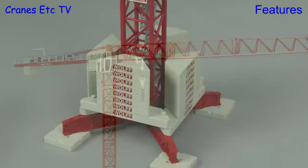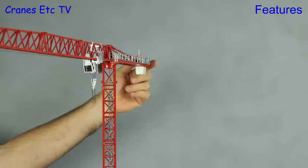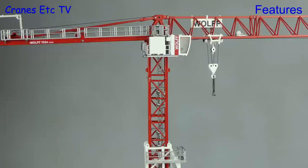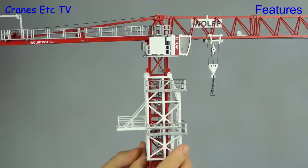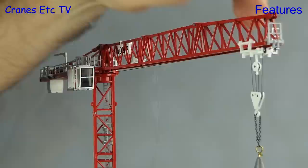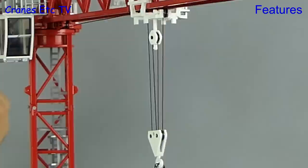Moving on to functionality — the crane rotates really nicely, very smooth without any juddering or jerkiness. Here it is with the 30 metre jib; you'd need a lot of space if you rig it with the 75 metre jib. The climbing cage can be offered up and bolted into position, but it's normal practice to have it lowered when the crane is working. The trolley can be moved along smoothly by hand, and here we've got a small weight on the hook to help the hoist rope run smoothly. You can also raise and lower the hook using the key in the winch drum, and as you can see the hook has been reaved with four falls of rope.